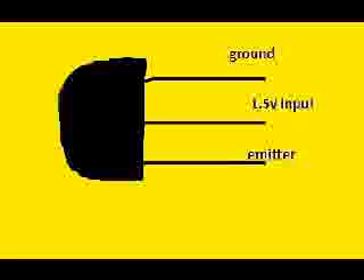When it comes to installing this thing, if you can't solder, don't attempt it. My video footage isn't so good, but you should be able to make out what's happening, otherwise you shouldn't be messing around with your controllers. Hi there YouTube, today I'm going to be doing a video on how to set up your lights on your 360 wireless controller to switch off when you switch the controller off. This here camera's not so lekker, but it's basically a transistor — if I'm not mistaken, it is a 2N3904.